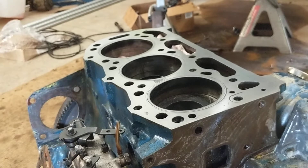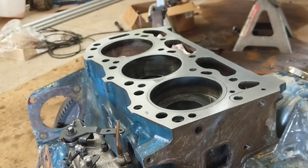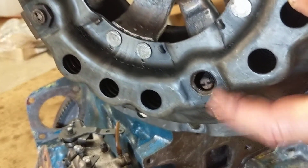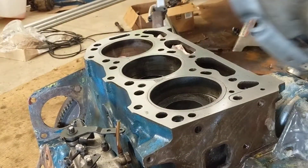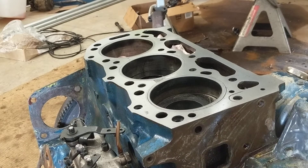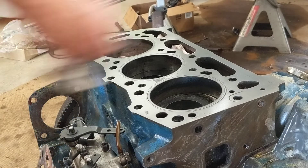Found out the clutch actually has a problem. You can see this nut strips out on the screws — that's what happens to these all the time. The clutch starts acting funky and grabbing weird. This is a Ford 4600 and I'm pretty sure the clutch fits at least 10 different models.